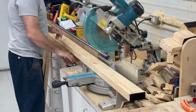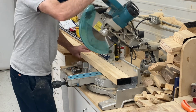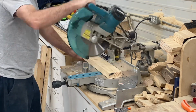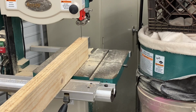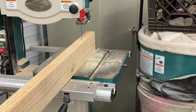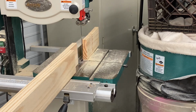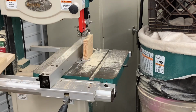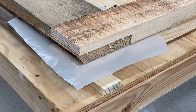These are kind of in the style of sliding barn doors. Usually in a sliding barn door situation, you've got two doors and they just slide together head to head. They open up full width, so each door is half of the door opening. Well, I've got a 30-foot opening. I've got a 40-foot building, so I don't want the doors sticking out like great big wings out the side when they're wide open. So I'm dividing them by 4 instead of 2. By doing that, they only stick out a couple of feet instead of several feet.